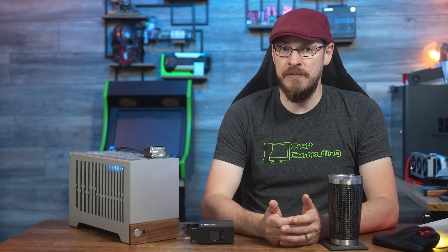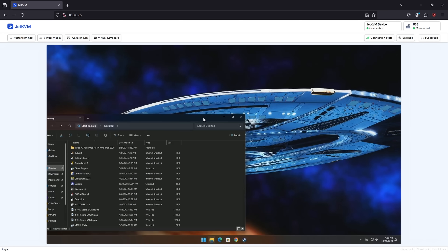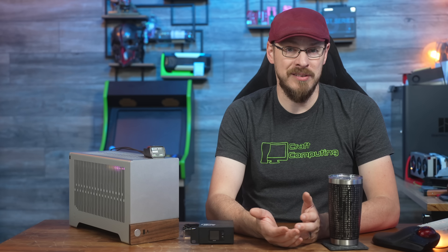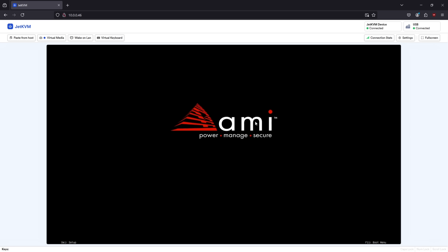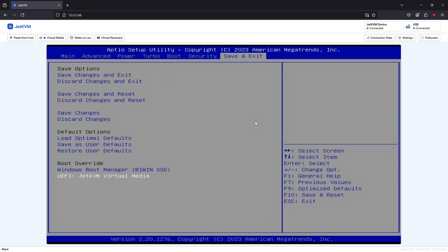The feature set of the Jet KVM is very straightforward. There's a main screen which is the pass-through of the HDMI input, which can support images up to 1080p and 60Hz — more than plenty for remote administration or support. And I know some of you are going to ask: no, you're not going to be able to play games from this. While latency is superb for remote desktop solutions, 30 to 60 milliseconds of latency with low bitrate compression wouldn't exactly make for the best gaming experience. The remote connection works very well, with both keyboard and mouse inputs being captured and sent to the remote PC. Mouse inputs on the web browser aren't captive either — your mouse is free to move around and off of the remote connection rather than needing a button combination to let go of it. One of the hallmark features of bare metal access is the ability to access a PC pre-boot as well. The Jet KVM is literally just a keyboard, mouse, and monitor in a self-contained streaming box, so you're not bound by software requirements of the remote PC.